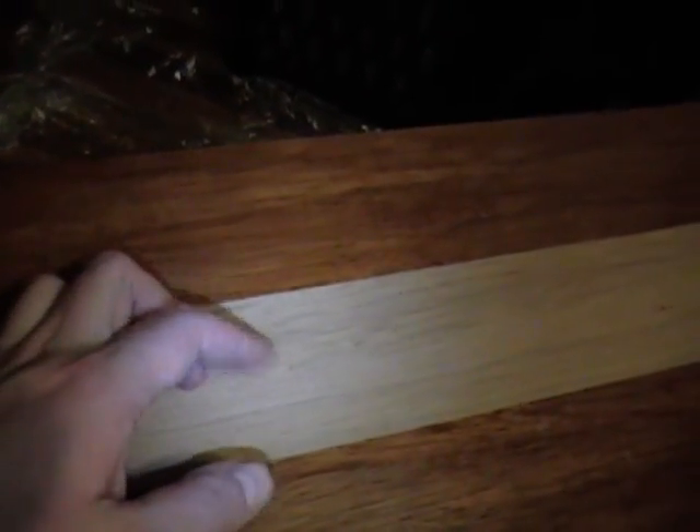I finally finished filling in the grain and sanding all the veneer surfaces smooth. Really nice now. By way of comparison, here's some untreated veneer — this is really rough and scratchy with all these open pores — whereas this is like a sheet of glass. It takes time and can be a little messy, but it's best to get it right at this stage, because any flaws in the surface are just going to keep getting mirrored as you put on subsequent layers.